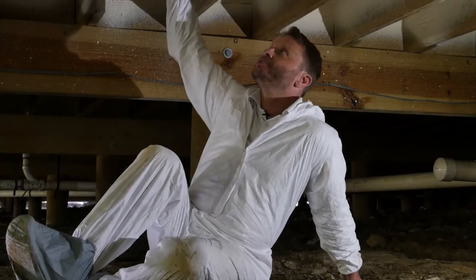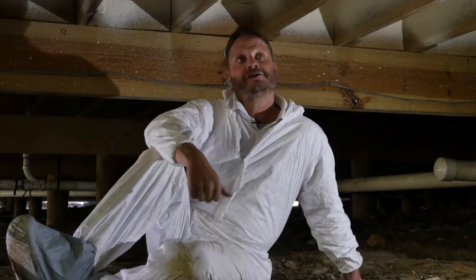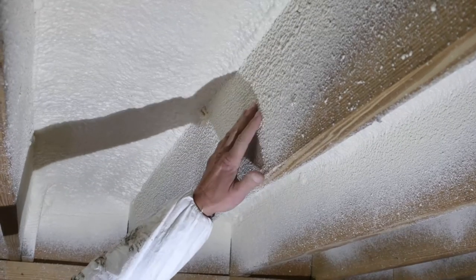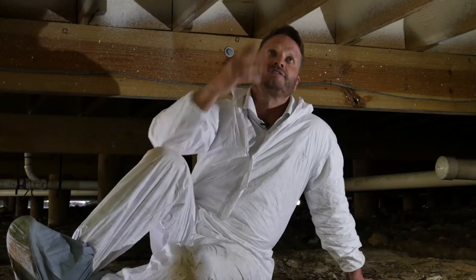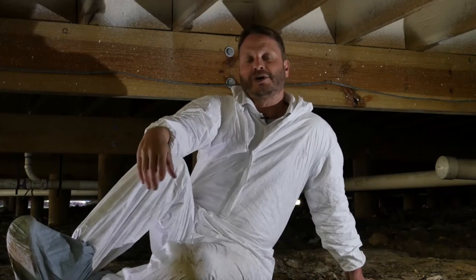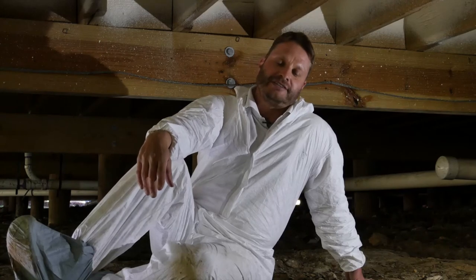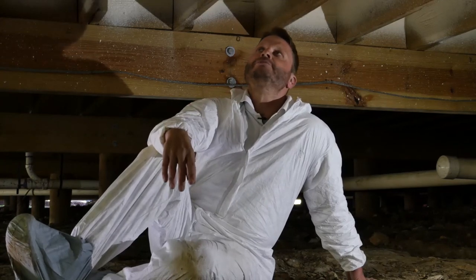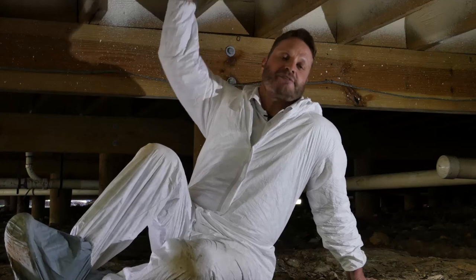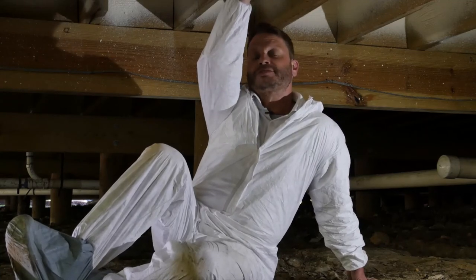Jeff, we see that you put the two inches of closed cell foam underneath the floor — I'm getting my air barrier, my vapor barrier, and the code-approved R13. But what about the floor joists right here? Is there the potential that you're getting some moisture coming up, diffusing into my house through these joists? That is a good question. The LSU AgCenter has done some great studies on building science. Their report talks about the importance of two inches of closed cell spray foam as best practice when insulating the subfloor, and also brings up some questions we can discuss. Go to our website, provide us your contact information, and we'll get you that report from the LSU AgCenter.